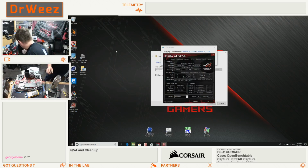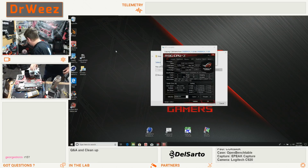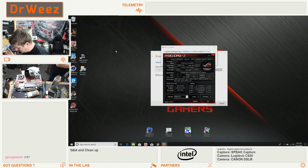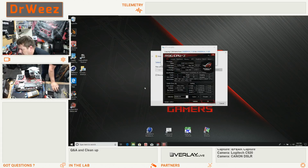So the dew point in Johannesburg at the moment is around 1 degree, minus 1 degree, around there. So when we have a constant temperature of -1 to 1 degree, that's when we're going to start getting some condensation. We just got to watch that, because I remind you, I don't have any insulation on this board because we have to return it in a decent state.